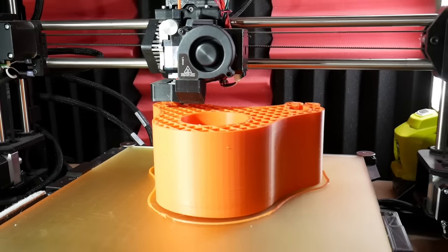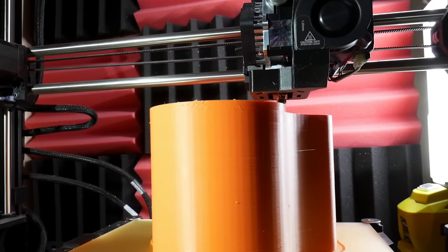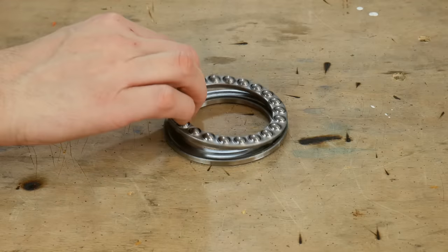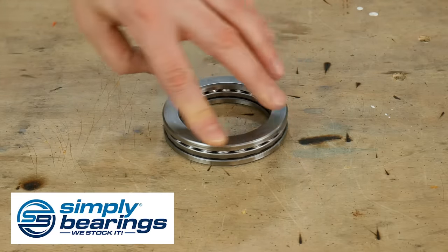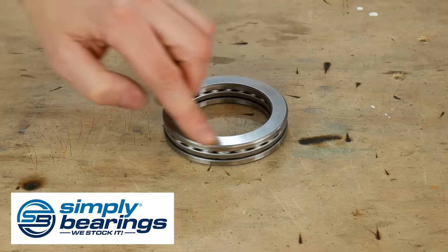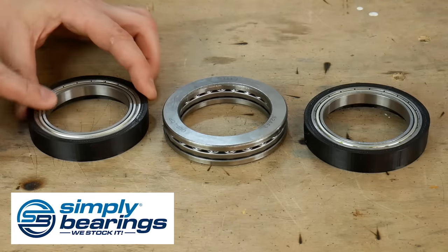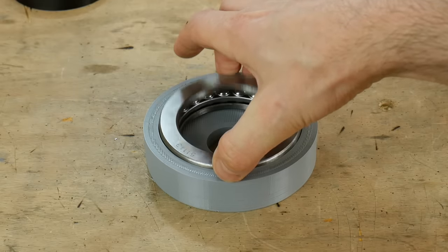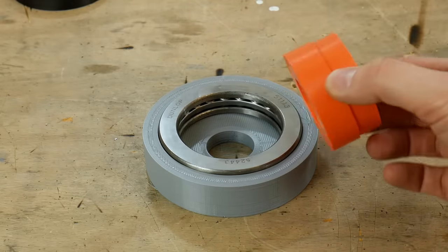So here's that steering column coming. It's actually quite a big chunk of plastic, and it's got those fat extrusions, so it should be really, really tough. I've got a thrust bearing which takes load from the top really well. This is actually salvaged from another project, but originally came from Simply Bearings, who sponsored it at the time. I've got some other bearings as well, and that's going to make up the main steering column. That thrust bearing sits into a little dish so that it can be constrained. It doesn't slip sideways, but it can still rotate.